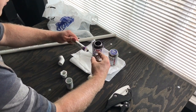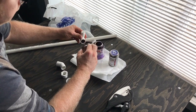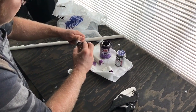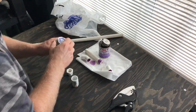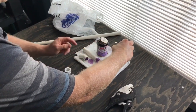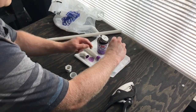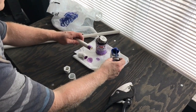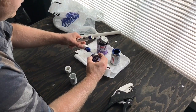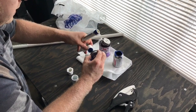We need to prime the PVC first. Let's go ahead and prime this one, and while we're at it, prime this one too. Okay, those are primed. Now we need to get the glue opened up. Because this isn't going to be under a lot of pressure, you don't have to use a lot — just a little bit will be sufficient enough.